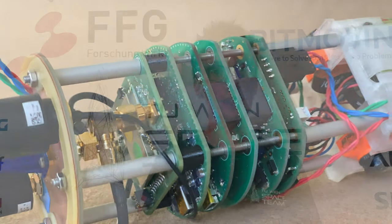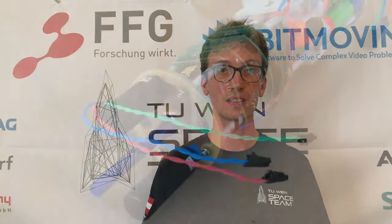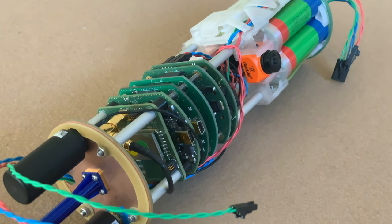— should inhibit the ignition of the upper stage if people are around the rocket at the launch pad, for example during the launch procedure. This year we changed the design so that we can include this device into our avionics stack, and we can get the status and see if it's working properly before we launch.